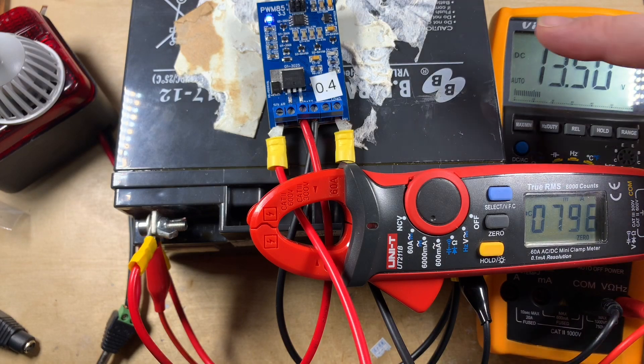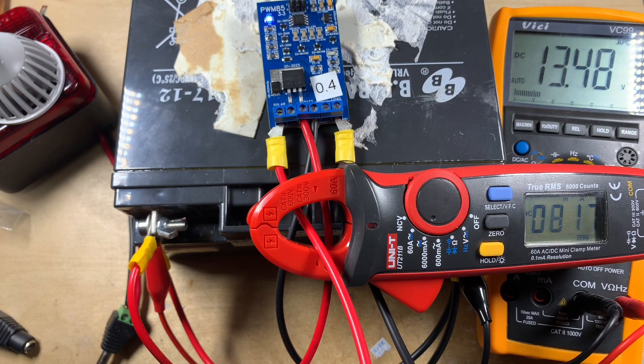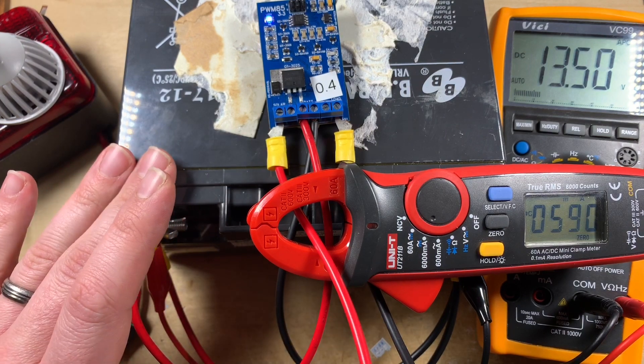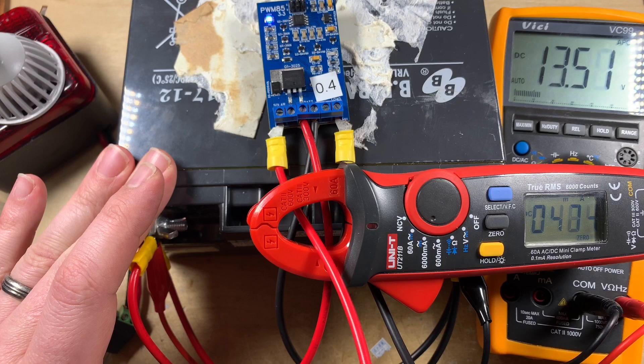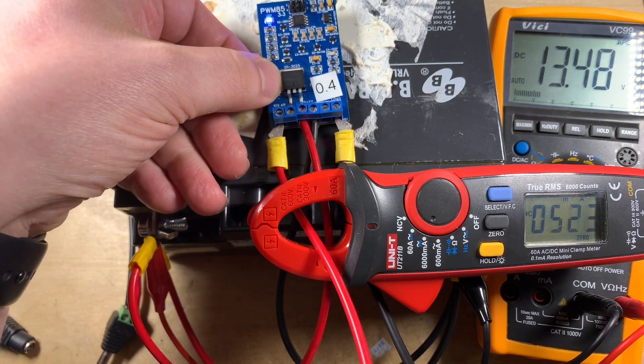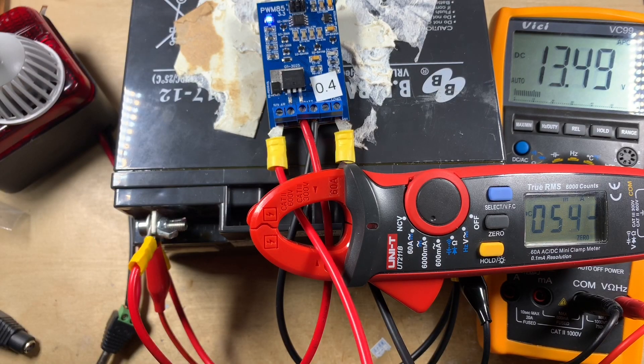Removing the last 5 watt load, the current should reduce to almost nothing and the battery voltage is staying at 13.5 volts. So I've been able to test two things — I've removed a lot of loads and the battery voltage has been very stable, and I've also been able to test that Schottky diode. Excellent — I think that's a reasonable result. Hopefully you've enjoyed this video; if you have, give me a thumbs up, subscribe, comment below, and I'll see you next time. Thanks for watching.